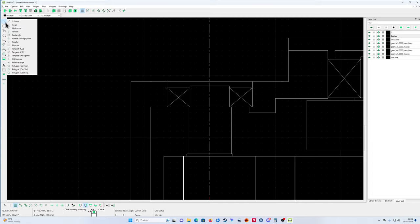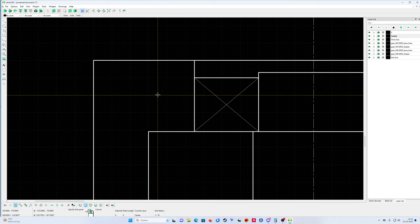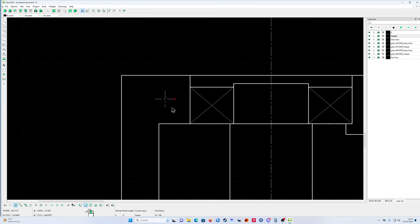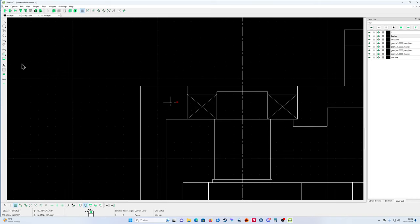Let's make a small center line. Let's say, what's a nice position here? Yeah, a little bit further away. This is a nice position. From here to here, and from here to here. Let's say the 1, 2, 3, 4, let's say 20 mil thread. Okay, with 20 mil thread, you have a hole of 18, 17 and a half, 18.